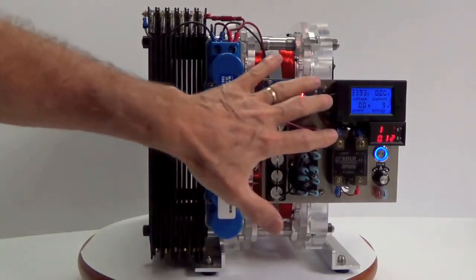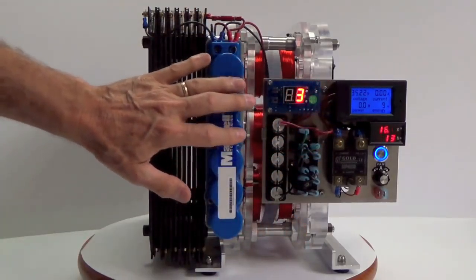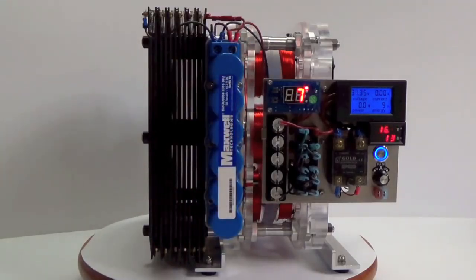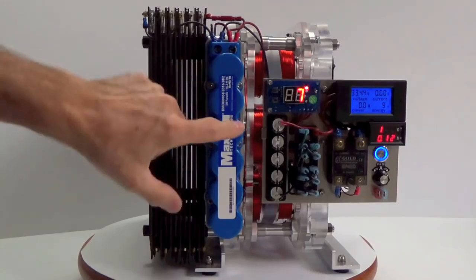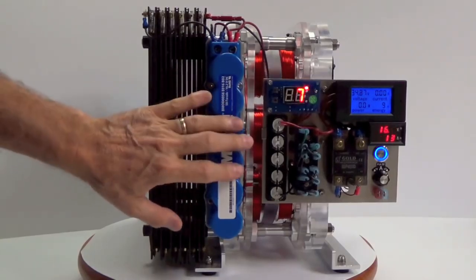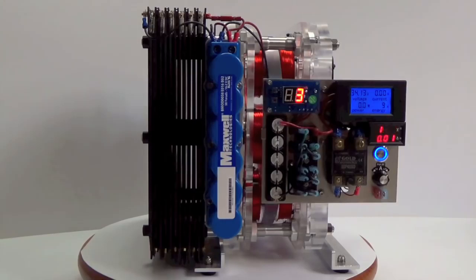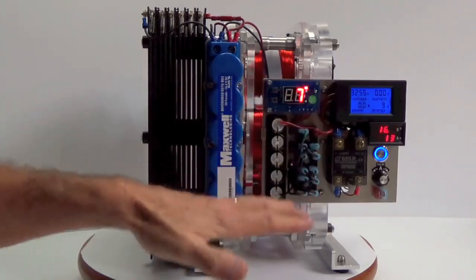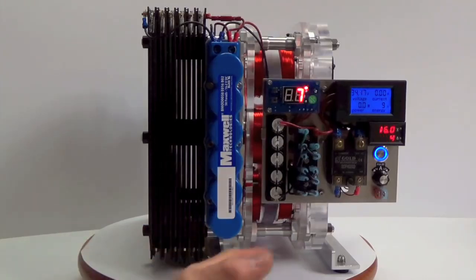That way, when you start extracting or discharging these two heavy capacitors, and it gets to a point where the cells can't keep up with recharging the capacitors at the same level that you are discharging them, then your power output, your watts, is going to drop and drop. And as it drops, the MPPT will take charge, and it will maximize the charge level at whatever you're feeding into it at the time. So it just makes sense to go that route. I just want to tell you that up front.